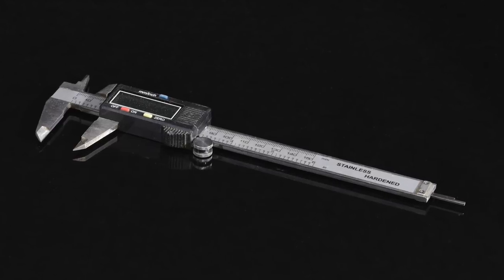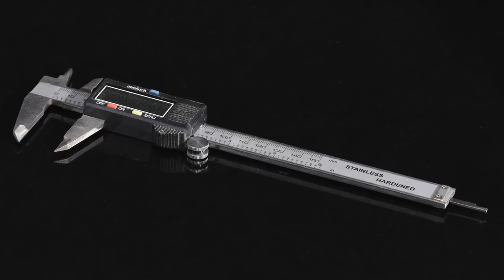There are plenty of other tolerances you might be concerned about, but let's draw some general lessons. First, the more good measuring tools you have the better, but I always start with a cheap $30 pair of calipers — I use mine probably 80% of the time, turning to fancier tools mostly as the exception. Second, for most fixed-blade knife applications — not so much folders — your eyes and your fingers are actually your best measuring tools. If it looks right and feels right, most of the time it probably is. Folders are a whole different question we'll get into another time.